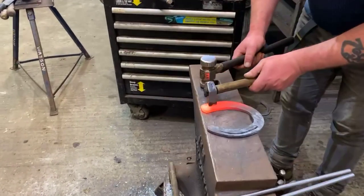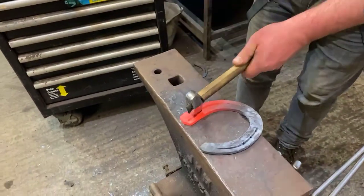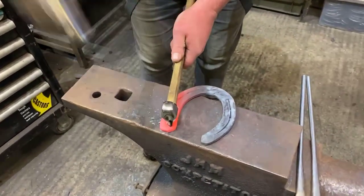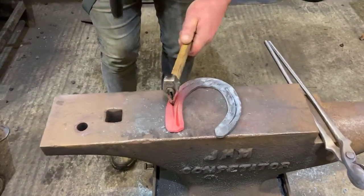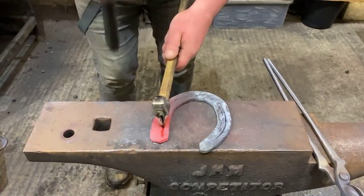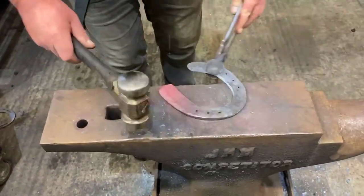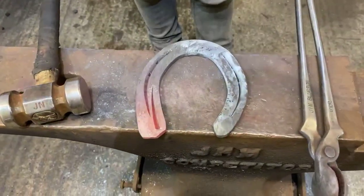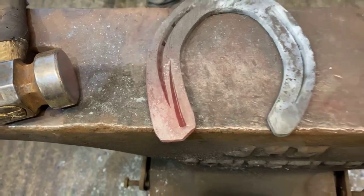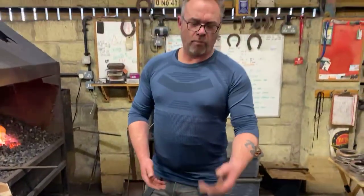So, get my fuller in, I'll put my stop end in the corner there. Okay, and then I'll just blend it down. So overlap, to make it look pretty. And again, that just gives us a little bit more if we need it. But they're all little things we can do when we get on the job, obviously, we left ourselves a bit of room to manoeuvre there. So we can either box it, hammer box it, spread it, put a bit more fuller in, you know, lateral extension doesn't need to have 2 bits of fuller in.